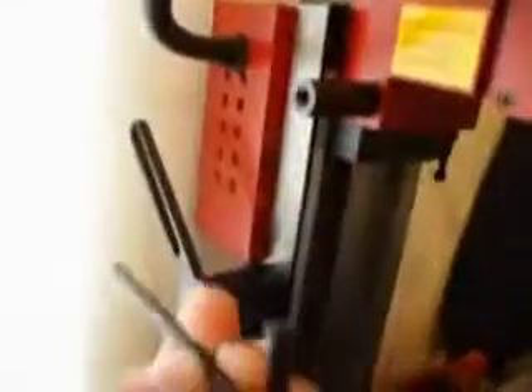This will then unscrew from the main block, remembering that this is under tension, so watch that it doesn't spring on you. The reason for needing to remove that is because we're going to be taking the head up past its end stop. To do that you're also going to have to remove the stop located in the top front of your vertical, using a 5mm Allen key. So those are the things that need to be removed from that side.